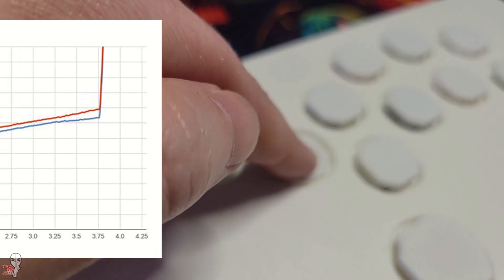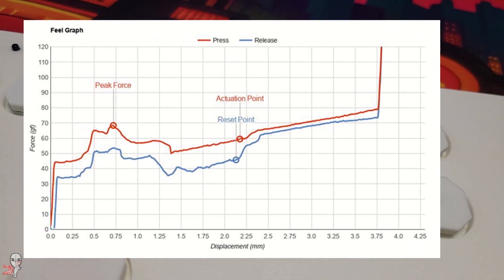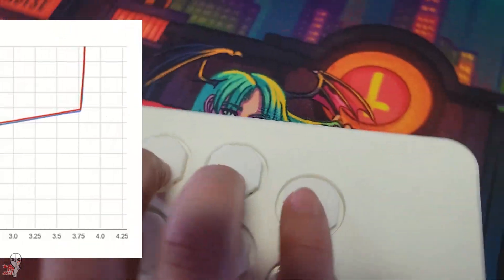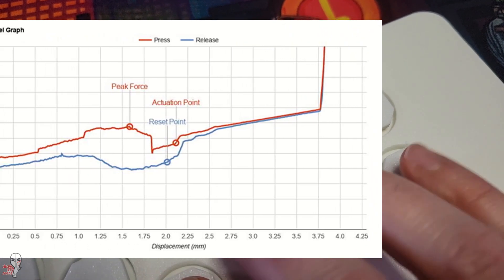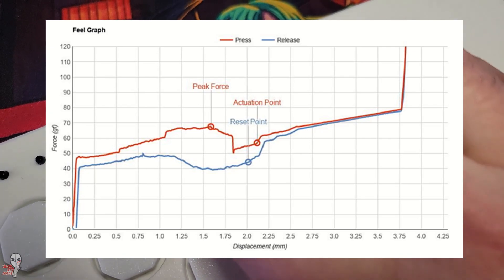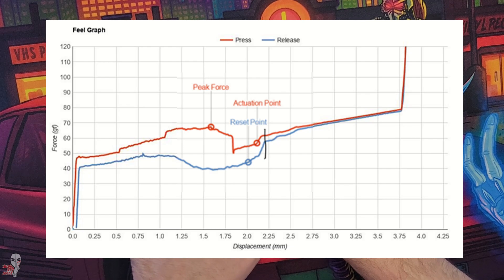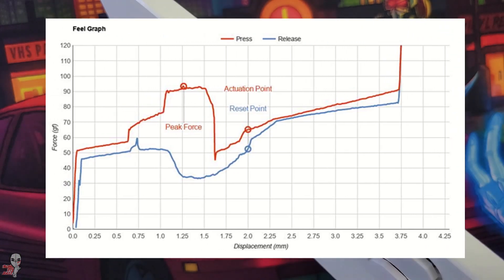Now compare that to the tactile graph. With tactile, you can feel those bumps. Those early ridges where the peak force is identified are very undefined — many bumps, peaks, and valleys. Shaper Dreaming describes this type of switch as scratching. The clicky style graph looks more like the linear travel path but with a large plateau just before the actuation point. The feel of the actuation point is before the click actually registers, which is the bump right after it. The point where the black line is drawn is where the click happens, and you can see a tiny spike in required force. The final graph showcasing the click bar style highlights a very high plateau of force that the user must get past.